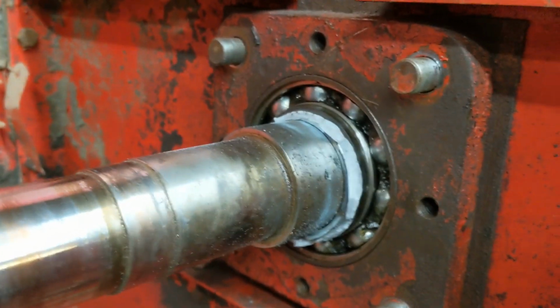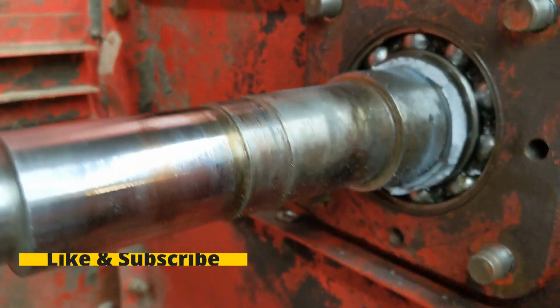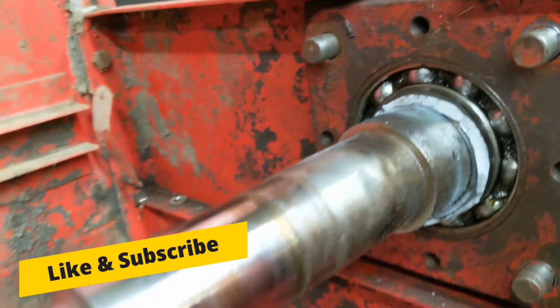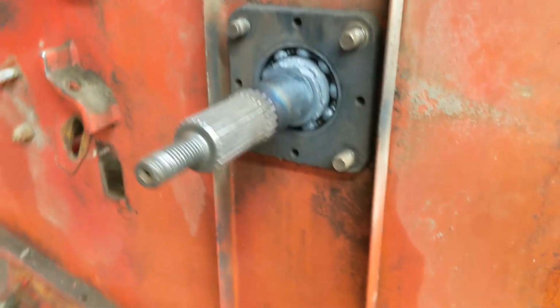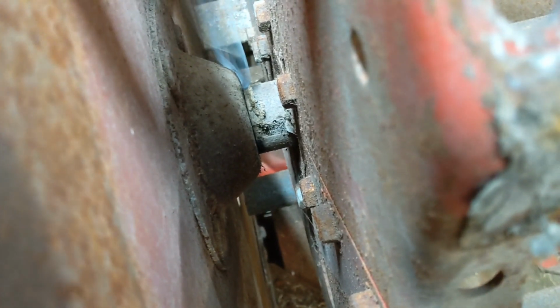I did it on both of them, and I had good penetration there, but I literally pulled the metal apart, probably from the heat penetration. And so I took the seals out. They probably used a Loctite also, so I did a preheat here. And you got to be careful. This combine's disassembled, but back there you can see it just pouring smoke out. If you had a machine all sealed up, you could burn up your machine.